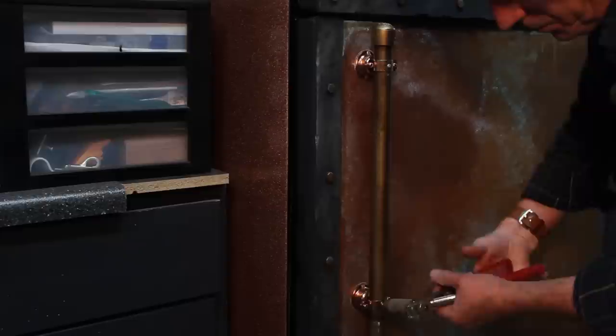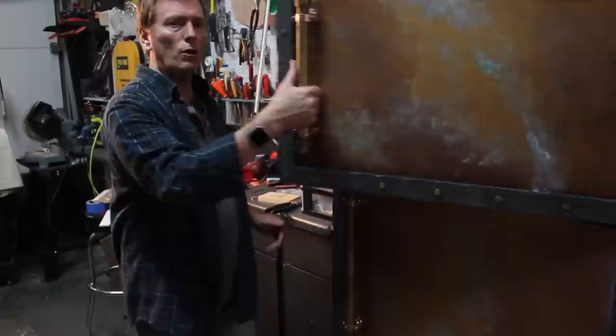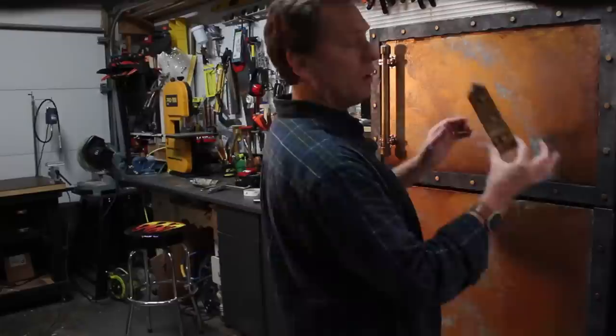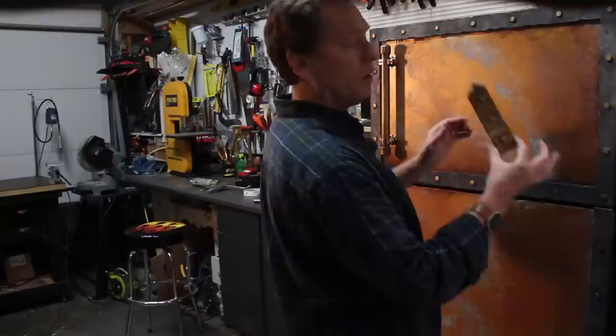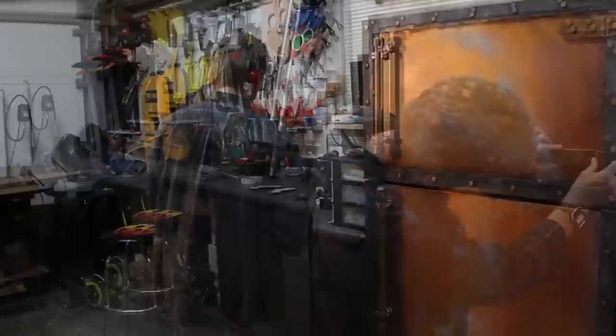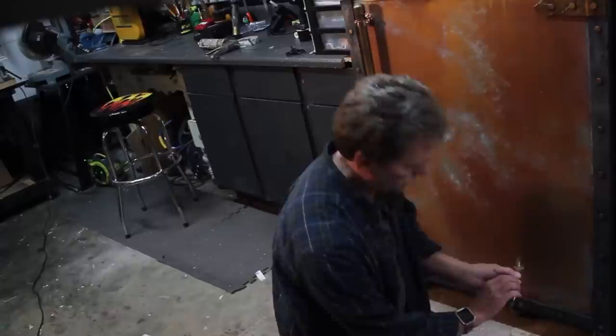I'm going to go ahead and set some screws into the front of them — that helps to lock the handles into place and then rotate on them. Now these work great, and our hinges that we built will be installed on this side, here and here. Using some liquid nail, setting the top hinge in between the two bars. The purpose of the sticky back is to hold it in place long enough for the glue to set up. Now you could have done those hinges in iron, but I thought the contrast was fun.